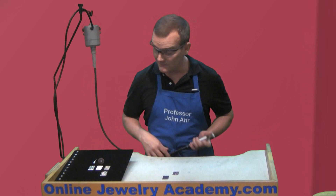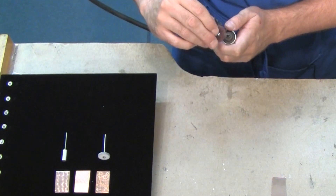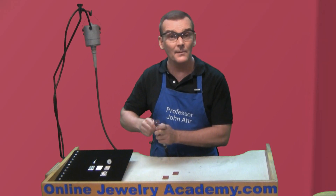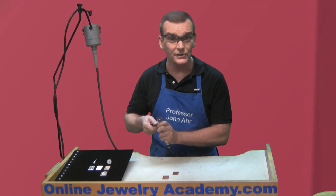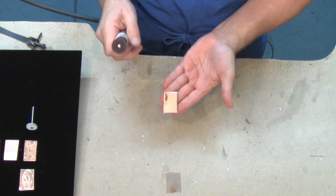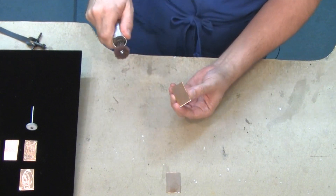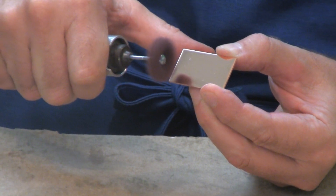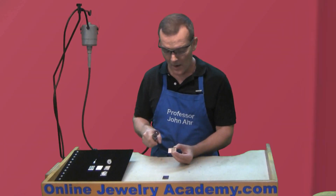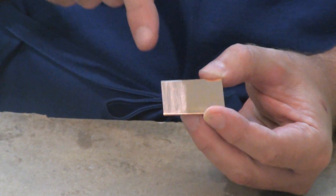Let's try next with the abrasive wheel. The abrasive wheel is really sort of a cleanup kind of tool, but we can use it to make a really nice matte finish on the surface of our metal. You notice that I'm starting with highly polished samples and working on top of that finish. You can pre-polish your work if you like, but for this particular piece you might be able to get away with a surface that isn't completely brought to a nice rouge finish. On my sample, I ran in just a straight direction to create a linear effect. Light pressure applied with the wheel to our surface going in one direction just creates some nice decorative lines.